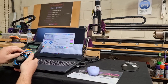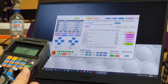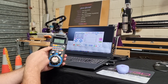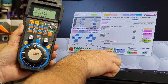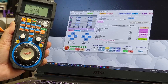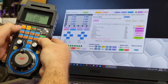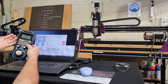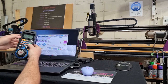The first thing we can do is set up the jogging function — as long as you can see which axis is selected you can jog that axis as we've covered. For example, the Feed Plus button: if I press it you can see it's changing the feed override on screen. To run a macro, you hold the orange function button on the side and then press the respective button — that runs macro one. While holding the function button we can hit macro two, macro three, and macro four, returning to our original position.